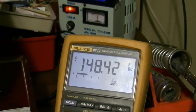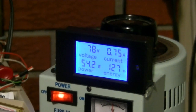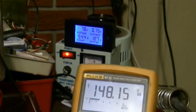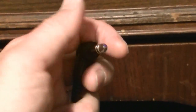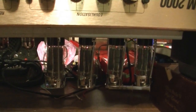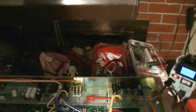I've dialed it up a little more — we have about 148 volts on the HT winding secondary and 78 volts on the mains input, at about three-quarters of an amp. We've got the tubes conducting and we're getting sound, which is a good sign. That means our output transformer is good and the tubes are probably all good because they're conducting — and that would go for both the preamp and the power amp.